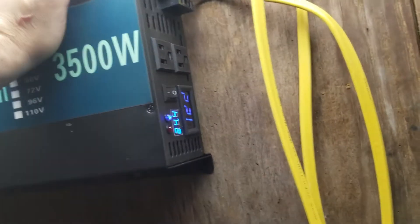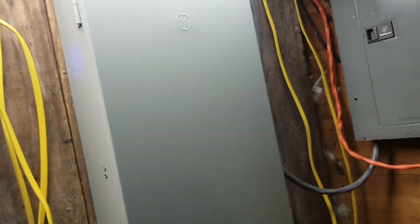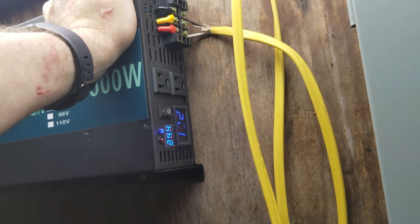We're slowly dropping in voltage. I only have six car batteries upstairs — they're mismatched and old — so we're only really looking at about 400 amp-hours of storage, probably even less than that. We're pulling down a little over 40 amps at 70 volts on our solar, which is being stepped down through the charge controller to 24 volts for this system.